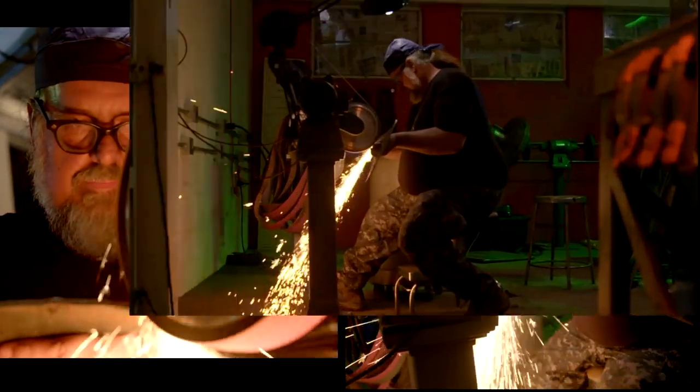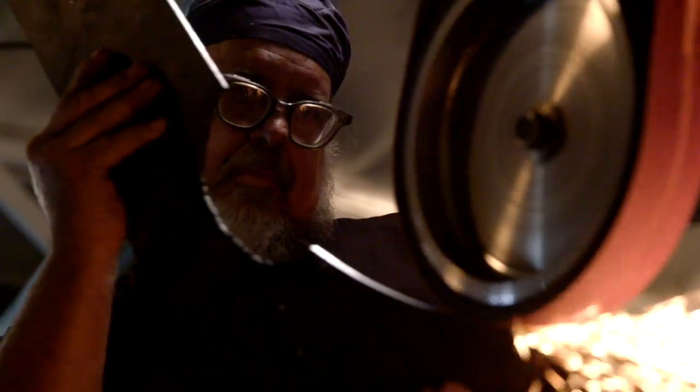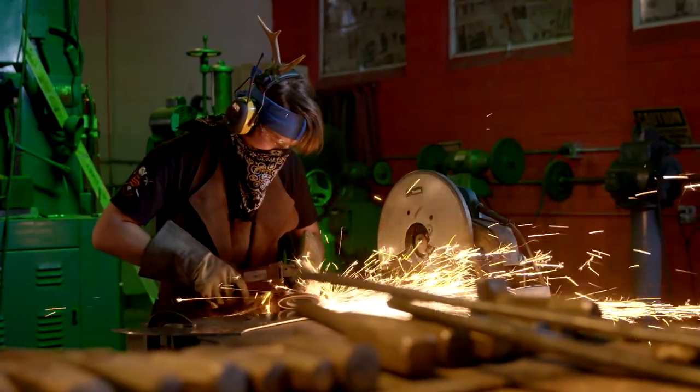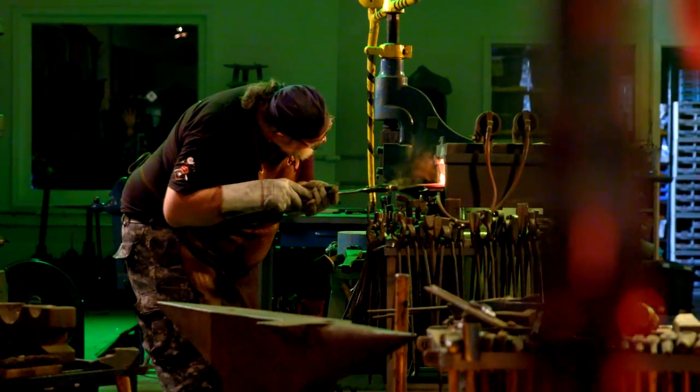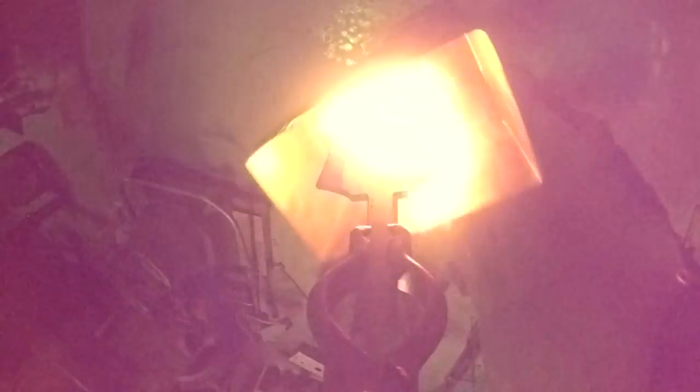At that point I take it over to the belt grinder and grind it to the shape I want just by eye. I use a two-wheel belt grinder with a 36-grit belt — it would take your finger off. After grinding the hollow grinds, I hand it off to Brian and he uses an angle grinder. We're removing enough metal to take off probably 10 pounds, so we're hoping to get the blade down to about two or three pounds. After refining the blade to the thickness and lightness I want, we send it out to a commercial heat treater. This blade is too wide to fit my electric heat-treating ovens, but I'll show the process using a miniature version. By heat treating and tempering the blade, it gives a proper cutting edge and makes it a real weapon — this should withstand almost any battle.